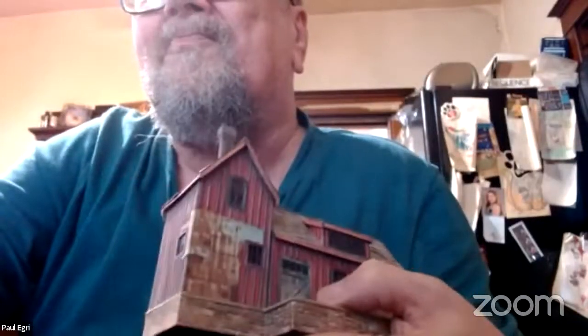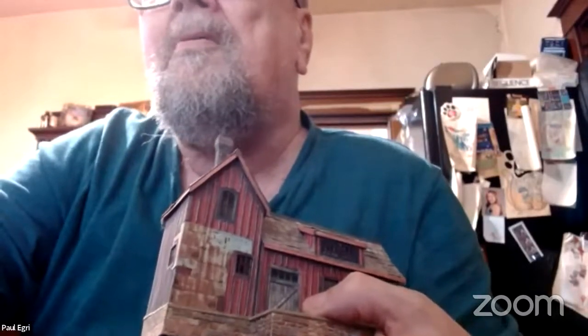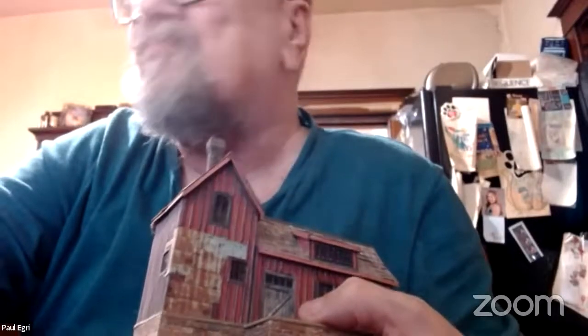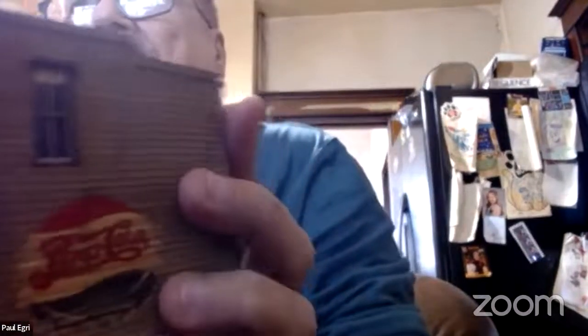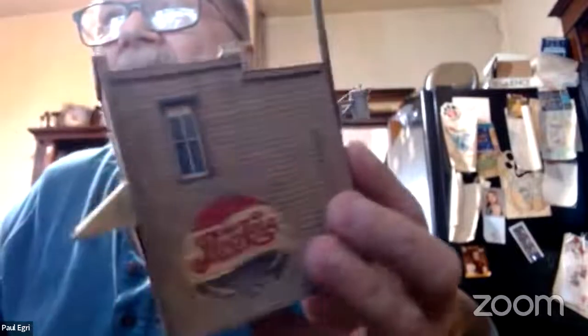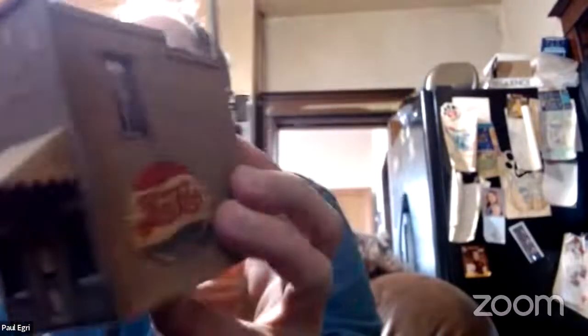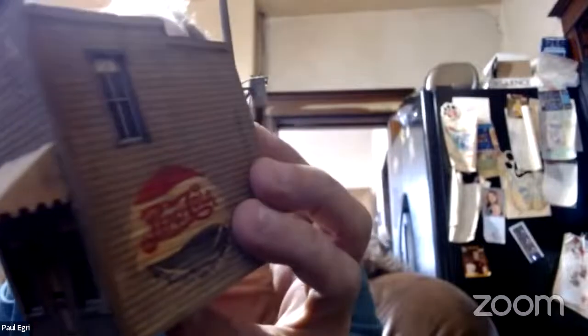Okay. But you know, we've got a real good question going here for scribed siding or for the paper type of thing. Do you guys go in and add, if you've got a wall that's 25 foot tall, just marks at 10 or 12 feet, or what do you do? I would cut it at 10 or 12 feet. Okay, and do you cut over the batten or just the board? No, don't cut over the batten. Okay, so your batten usually runs over top of that area where it's cut. Right. And you can cut it up higher or lower. Right.